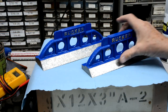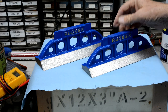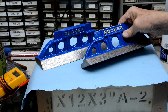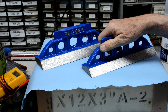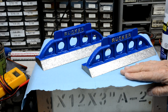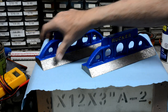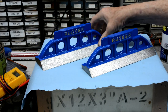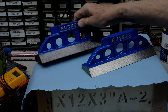I finished the project — painted them up. I like this machine blue, and it gives a little accent to the letters. This is a good project to learn to scrape on. It's small enough that you don't need a very big surface plate to do your spotting. And it has a flat and a 45, so you can practice two different types of surface.